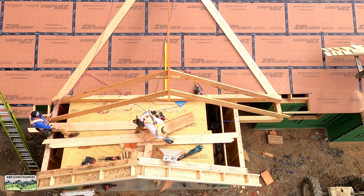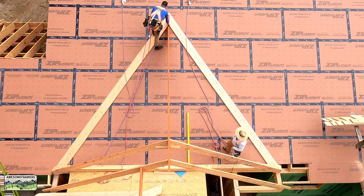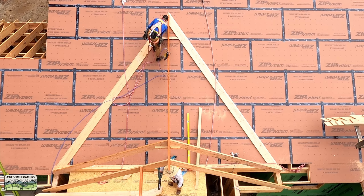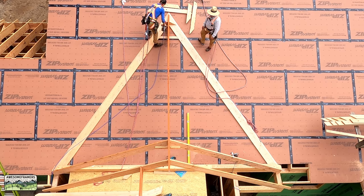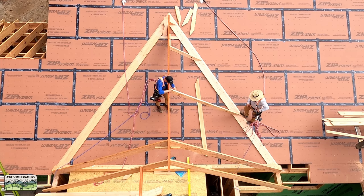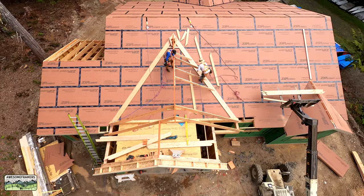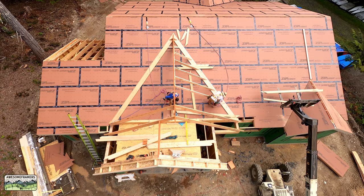In line with the gable, we mark and locate that lower ridge, cut it to fit, and set it. Now we've got the skeleton tacked — we double-check that everything planes, run a string across, and double-check for level. Then it's time to start nailing those California jacks. We blast down the sleepers, nail them off into the rafters below, and support the heel of the LVL ridge. We set the very first shortest jacks — the shortest jack is 12 inches — then measure two feet off across the ridge, block as we go, and keep checking that jacks are parallel to the gable end.